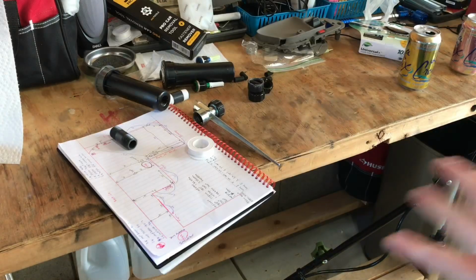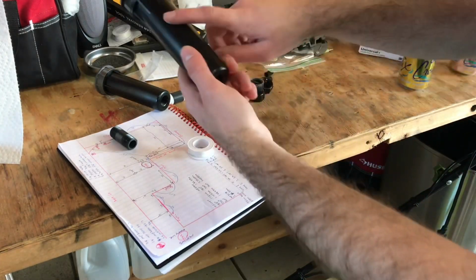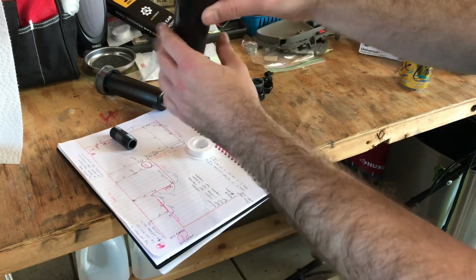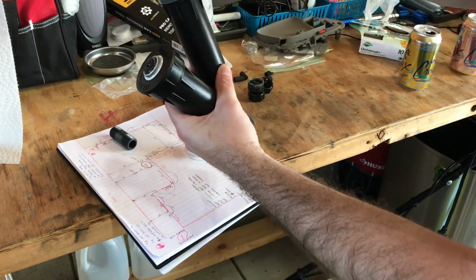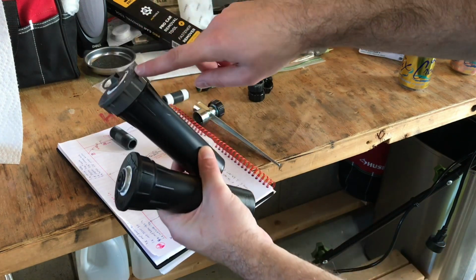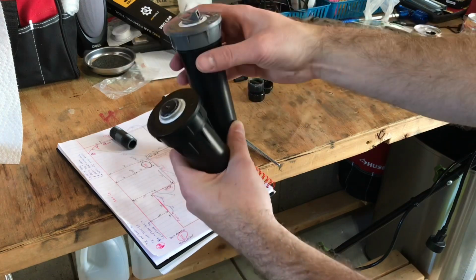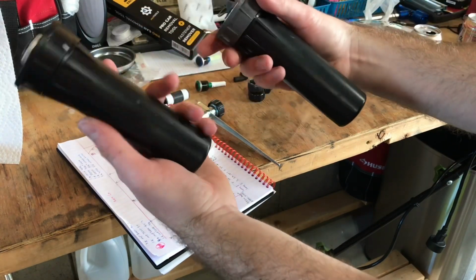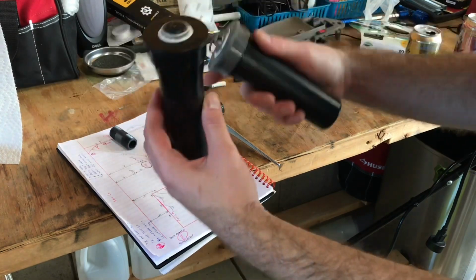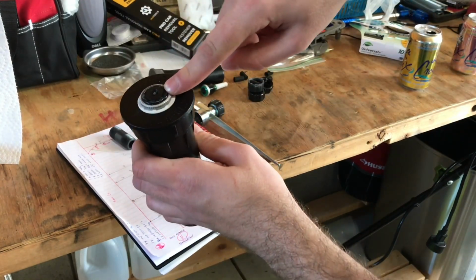Okay, now I'll show you how to actually assemble the Hunter Pro spray head. So this is the spray body. Hunter PRS 40 is the gray one. The PRS 40 denotes that it is a pressure regulated one. So this is regulated to 40 psi, which is recommended for the MP rotators for more consistency. The black ones, that's just a standard Hunter Pro spray. So you can see when you order them, you can either get them with the nozzles installed.